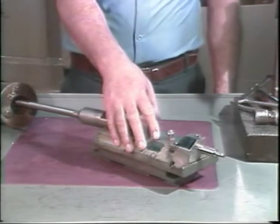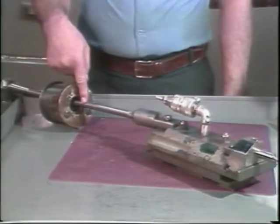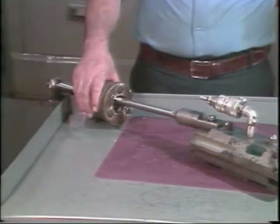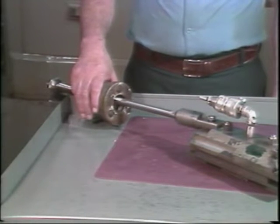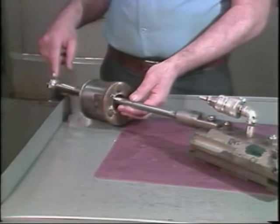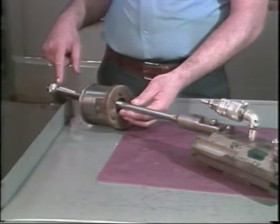This is a universal recessing attachment. It is activated only by a draw rod fastened to the power case with this block. The attachment is mounted to the tool slide. As the tool slide moves forward, the draw rod connected to the attachment slides through the block in the power case wall until these adjusting nuts are reached.